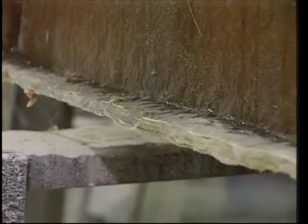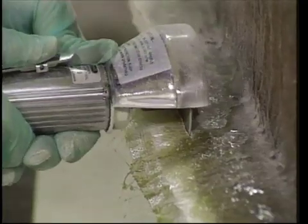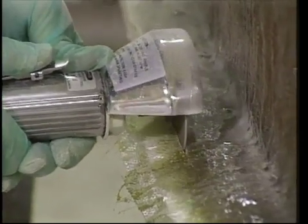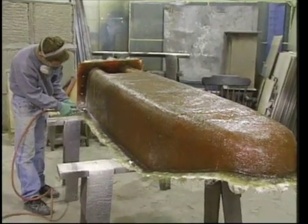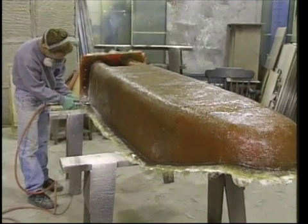The finished mold is about 5/8 to 3/4 of an inch thick. Fiberglass this thick takes time to trim even with the proper tools. To begin the modification, the flange was neatly trimmed using an air cutoff wheel. Notice that I'm wearing long sleeves and a respirator — heavy fiberglass dust like this is best kept off the body and out of the lungs.